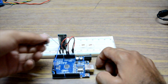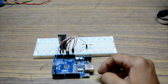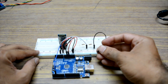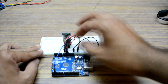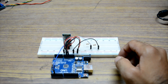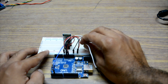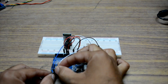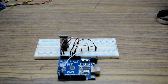Take the RX pin from your Bluetooth module and connect it in between the two resistors. Give the 2k resistor end to ground. The output from the 1k resistor side — take another white wire and give this output to pin 3 of your Arduino. We are using pin 2 and pin 3 as defined in the code. This completes the Bluetooth module circuit.